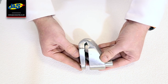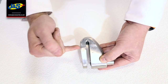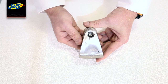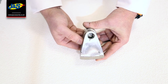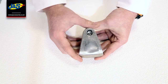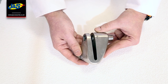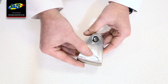They've also attempted to cut through. This is stainless steel, not zinc alloy, so it is a hard metal and it takes a lot of effort to cut through with a hacksaw at that angle as well as through this angle here. They also tried to drill out the bottom, which was unsuccessful, as well as hitting it with a hammer to see if they could create a shatter or crack. This was also freeze tested using a standard plumber's pipe freezer to see if they could make it brittle. One of the things which is really important for the KLL range is the double locking mechanism.